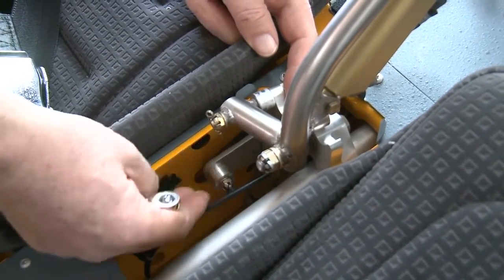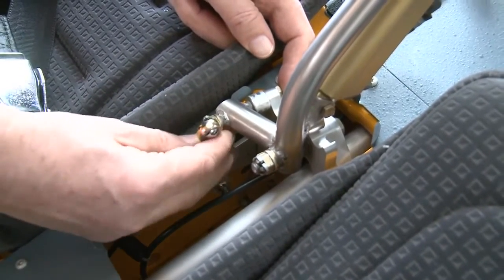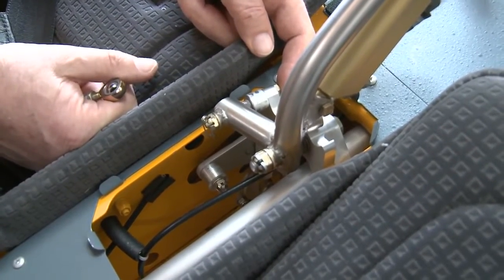All we've got to do basically is take the split pins out, the safety pins out, take these bolts out, replace them, put the lever in and tighten up the bolts, then put the safety pins back again. It's really a very simple procedure.